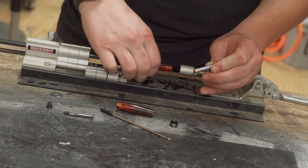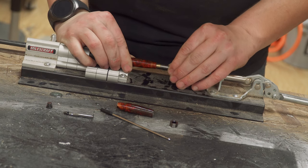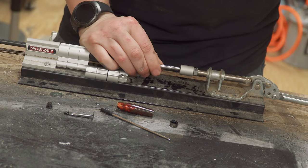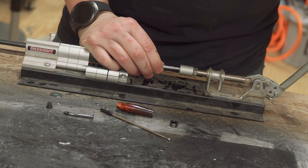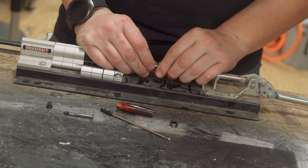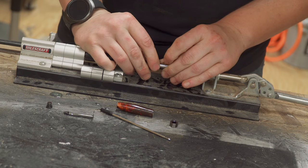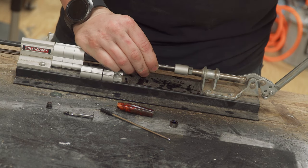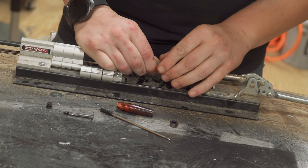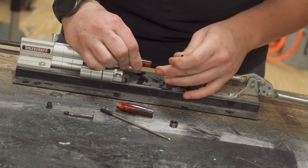So just like with the tip, insert into the hole in the barrel. Make sure you've got enough room to fit it within the pen press. And for this one, you might have to kind of guide it and keep it from flexing or turning, because it will try to flex around sometimes. Sometimes they fit without a hitch. Other times you have to stop them from flexing a little bit. So make sure to not let it twist or pop out like that. As you can see, even people like me have trouble with it sometimes.